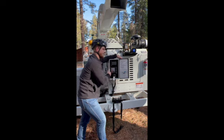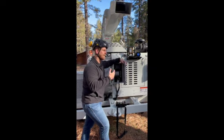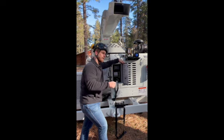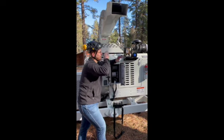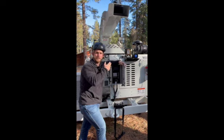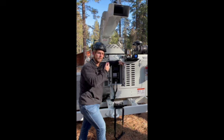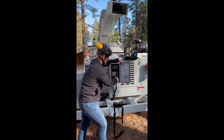If there was something preventing us from running, for example, we have the hood pin up top on the knife housing. If that hood pin is unplugged, there's going to be a little sensor here flashing. It looks like a half circle with an X through it. The machine's not going to start up. That's just telling you that your hood pin is unplugged up top. So turn the key, I'll start it up here and then I'll shut it down for a second.